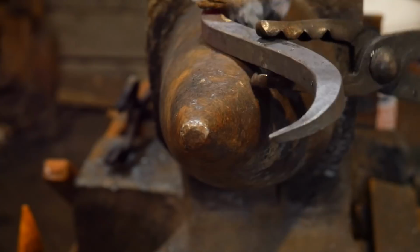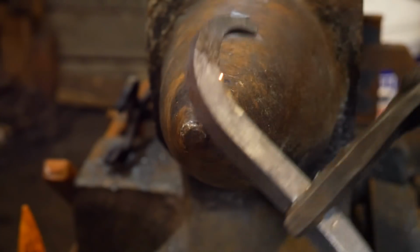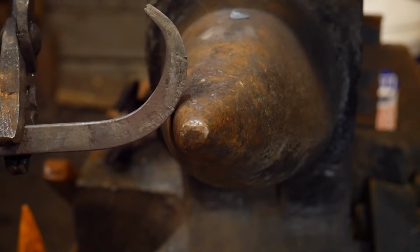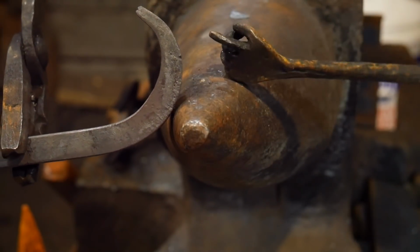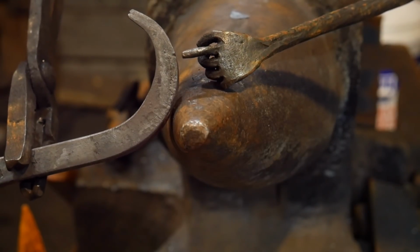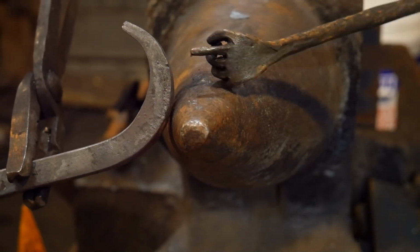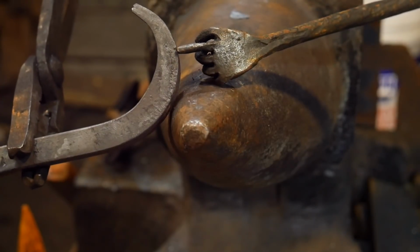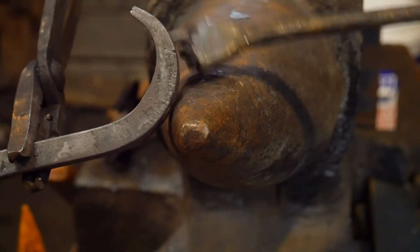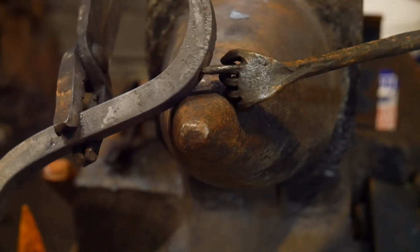The problem with this that eludes most is the fact that if you look right there on that edge, there's a crack. Clear, right here. That there is a failure point. That's a stress riser. That tip will eventually break off. While this may not be as important in ornamental work, where you can just grind things off and clean it up and fake it till you make it,